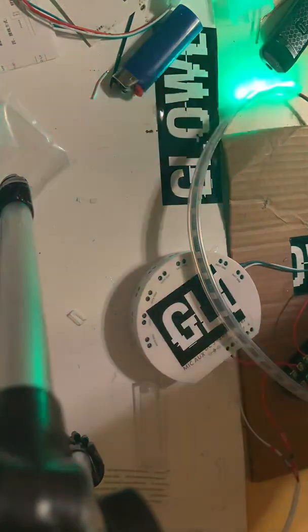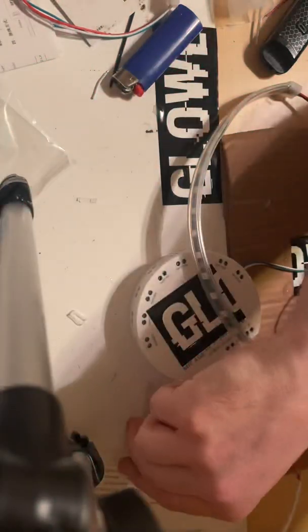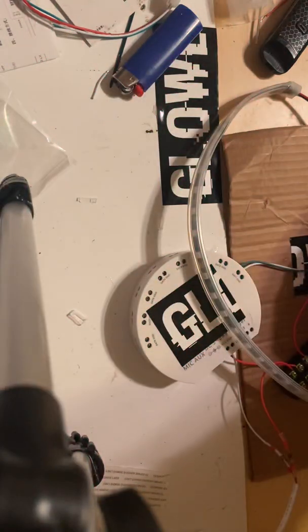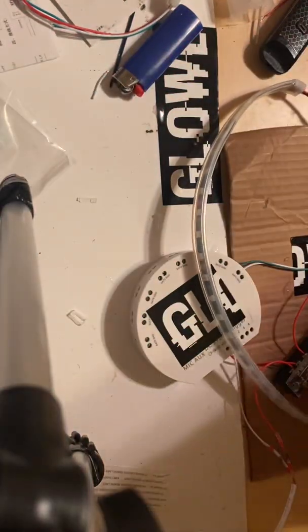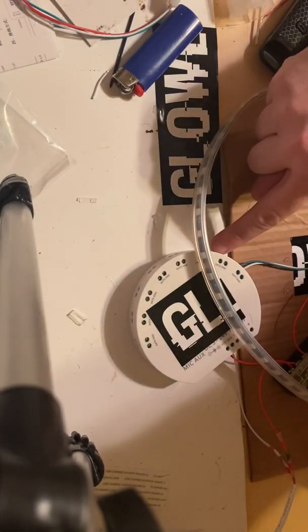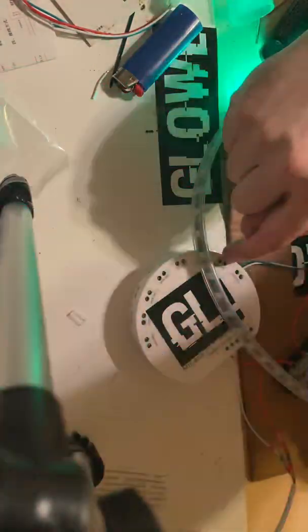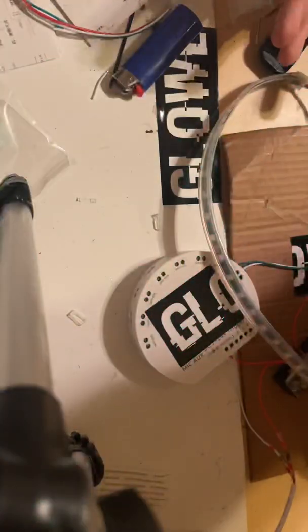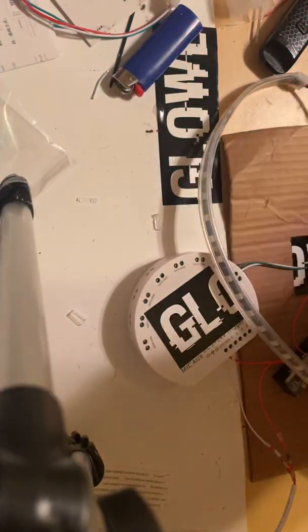The pattern is a little long right now so it's going off the end of the strip, but as you can see it is working. We just had to give it power differently, from a distribution block. My distro blocks online also come with a nice cover that you can snap on — it keeps the screws safe and gives you a nice power distribution point. You would do this for basically every run of power. In other cases, use data and ground from the box and power from the distribution block. Also, you don't have to use the ground from the box — the ground inside the box is just a distribution block, so as long as you have a common ground, you can ground to your chassis and run strips to chassis ground. Data is the main one that actually controls your zones. That's the quick rundown on the UFO.